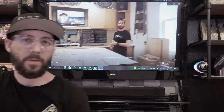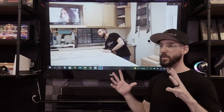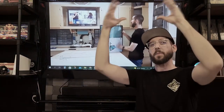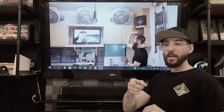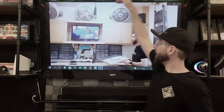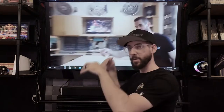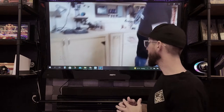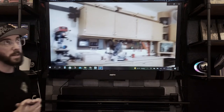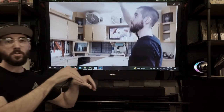Now going into filtration. You can get filtration for your shop — those little boxes with a fan that filtration goes into to capture airborne dust. I took a customizable washable air filter and custom-fit it behind the fans. That way I can let it run for a week, then take it off, hose it off, let it dry, and put it back. Reusable. And it helps keep the shop clean. Towards the end of the video on the paint booth aspect, you can see me blowing the fans clean and how much dust has clung to them — so having filters in the back is really important.